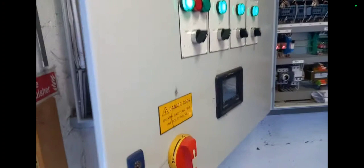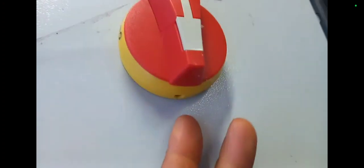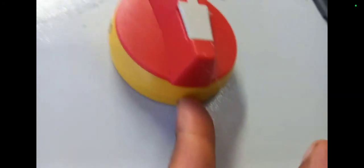Here you can see I've switched off this unit and removed the fuse — that's one form of safe isolation. See the boots I've got? Make sure you've got rubber-soled boots. Notice there's no mat here underneath the panel — watch out, there's a reason why there should be a mat. This is how you get in underneath into a control panel without turning the power off — you press underneath here and you need a little key, like one of these panel keys.